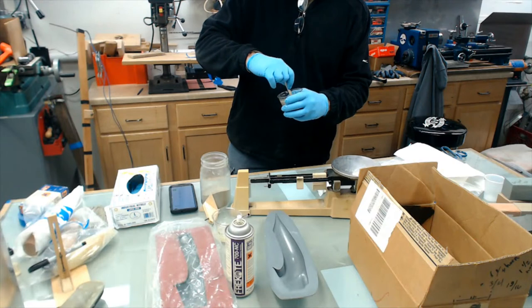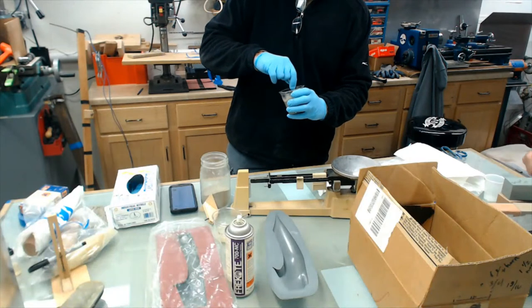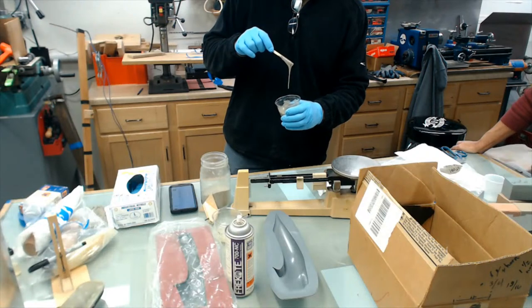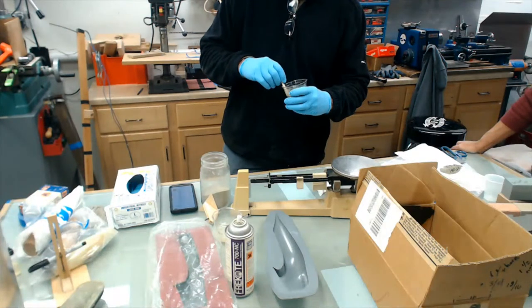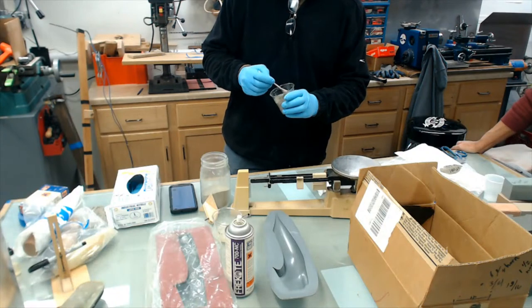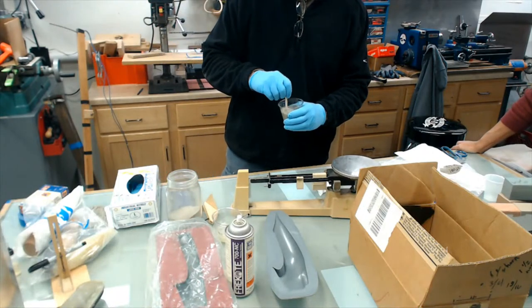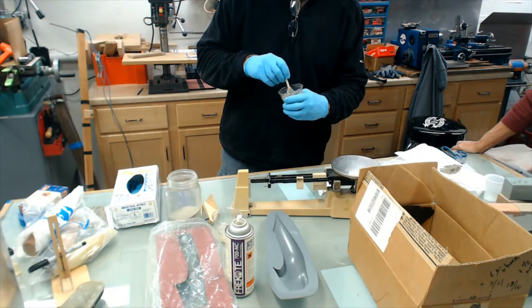So with the DT081, this isn't something that's mixed up by weight. What you have to do is mix it by feel and look. And right now, it's almost like a casting resin. And to be honest with you, if you didn't want to use that casting resin and you wanted to use HTR 250, this 1063, you could almost come up with your own viscosity. Basically, this is like micro balloons or whatever, and you can add however much you want to get the consistency of mayonnaise or toothpaste.